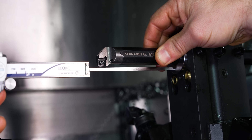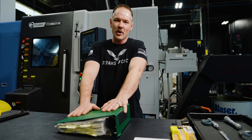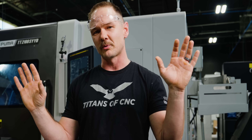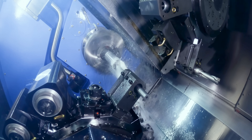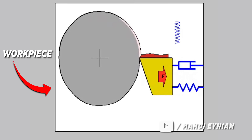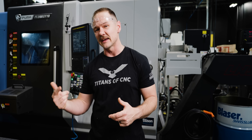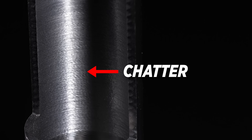Today we're going to help you with the tips and tricks to solve chatter. This is a very large book with a lot of information in it, and that is because chatter is a very big problem with a lot of solutions. We're going to cover just the tiniest sliver of that enormous problem. What is chatter? It's that whining, screaming noise that comes out when your machining parameters aren't quite where they need to be. Chatter is a vibratory occurrence happening between your workpiece and your cutting tool. When those two surfaces are rubbing against each other, the tool can actually be bouncing against that material, and during that vibratory process it begins to sing — that's why you hear that whine or chirping sound, and it gives you that infamous wavy pattern on your part.